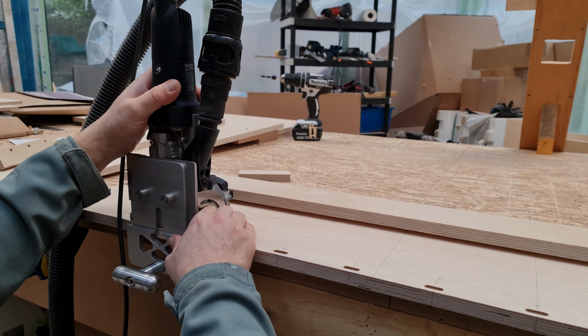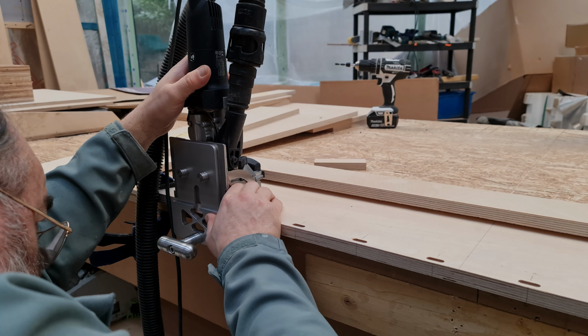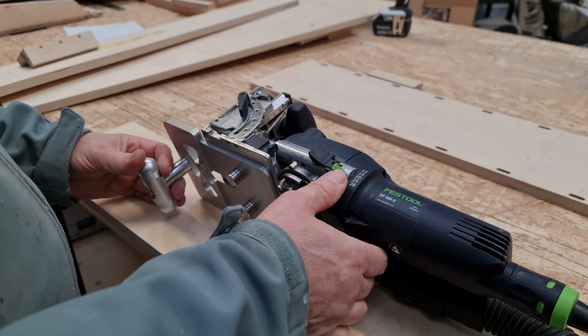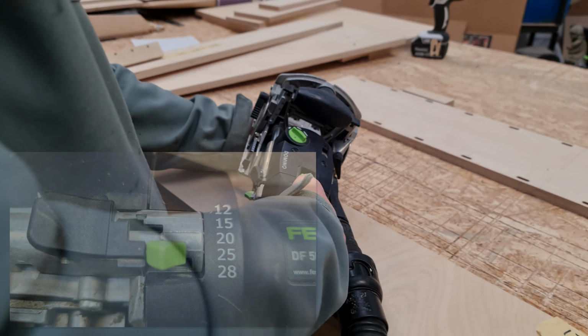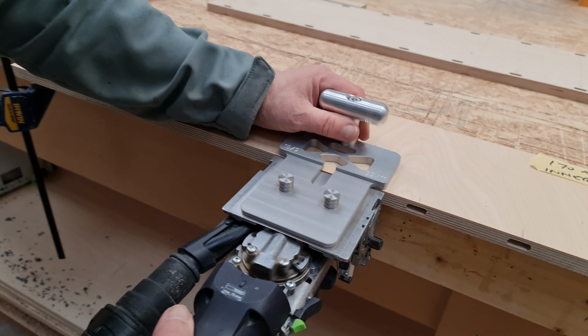The first ones were done with my hands out of the way so you could see, but you will see later with the large plate it is a comfortable and stable grip for the rest. The end grained holes are now cut at 25mm deep, quicker and much less likely to tear out.